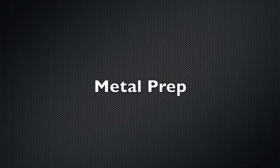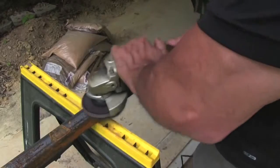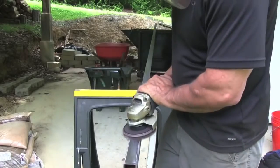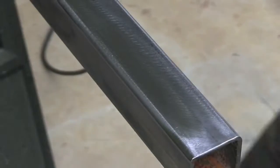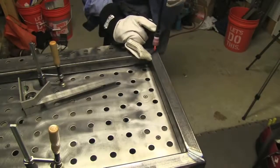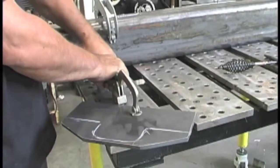What about metal prep for MIG welding? It's hard to say across the board one particular level of metal preparation because it varies from situation to situation. Like, there was a rust coating on some square tubing that needed to be cleaned off because I was going to do both TIG and MIG welding on it. For MIG welding alone, if it didn't have rust at all, I may not have cleaned it. But because TIG welding requires a lot more cleaning than MIG in general, I cleaned the weld areas to clean, shiny bright metal with a flap disc. Also, anytime you're using flame cutting, you need to get rid of the dross — you do not want to MIG weld directly over that oxidized dross surface contamination from oxyfuel cutting or plasma cutting.